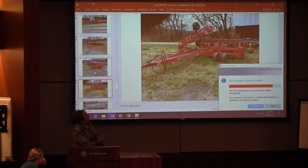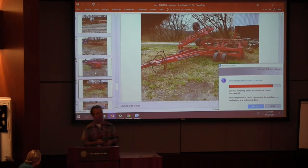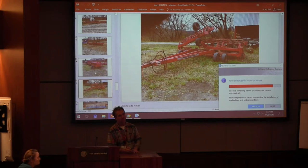This is an Unverferth rolling harrow — a really cool tool. It has leveling blades that sit in front of the baskets, then little tines, then two sets of rolling baskets, and it's 30 feet wide. We were worried about making really smooth hay fields, and one pass of this makes fairly rough land pretty darn smooth. It's also great for incorporating broadcast cover crops. You can also do stale seedbed with this rather than the tine weeder — every pass just makes things smoother. This is $5,000 out of Quebec, in good shape. A really awesome tool, covers a lot of acres in a short amount of time.